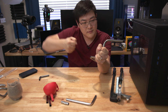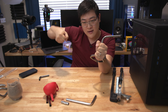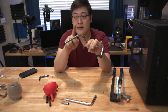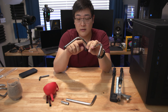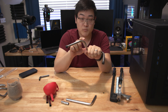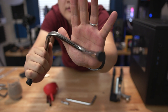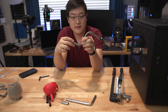If I pull it back a little bit and rather than doing that very sharp turn, try to bend it at a wider angle, I get a slightly better result — it crushes the tube less. But that's primarily because I'm going with less of a sharp radius. It's a bigger radius, but you can still see that wrinkling effect right there. I don't think this result is usable either.